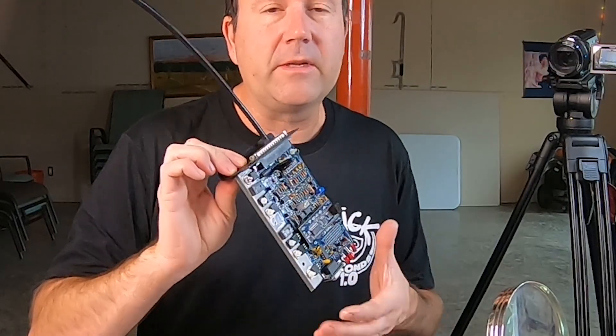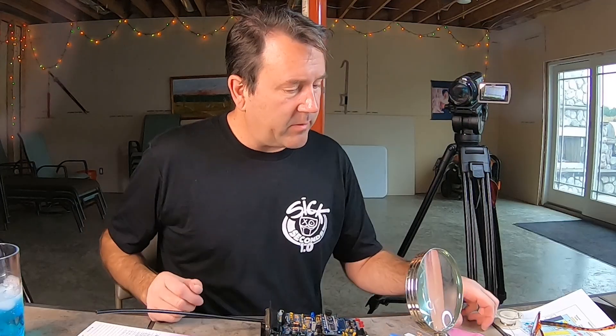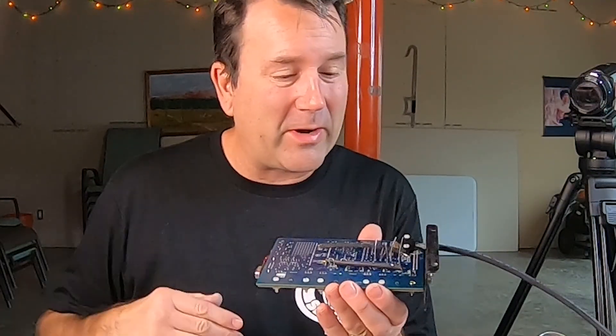Well, that's about all I can show you today — I've got to get some parts ordered. I need to order some more resistors; I read further in the manual and didn't know I needed them. Transistors that go on the heat sink require an insulator — I didn't order those either. There's a special screw, washers, and a little sheet of plastic that goes on that heat sink. These are basically flyback circuits for running low-impedance injectors, which we're probably not going to run, but you never know. I'm trying to build this board like Simon's board. I've got all these tabs to cut off — the longer ones I'll save in bags for future use.